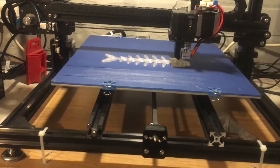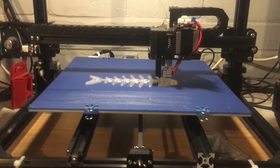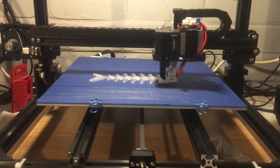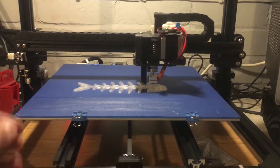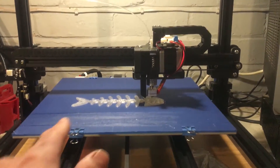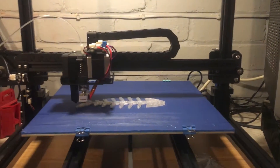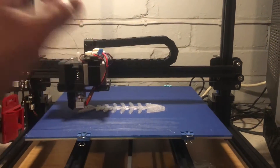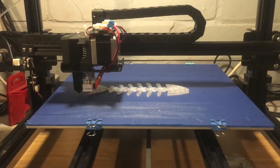When I set it up it was an absolute pain in the backside to get the bed level. It turns out, if you turn the screw slightly, the wing nut goes rather loose with the bed barely moving. You have to move both the bottom two at the same time, and again at the top, to get it where it'll only take a piece of paper.